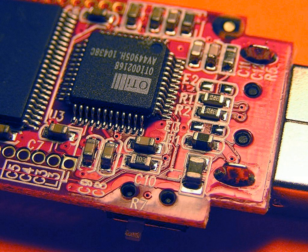Thin small outline package TSOP, thinner than SOIC with smaller pin spacing of 0.5 mm. Shrink small outline package SSOP, pin spacing of 0.65 mm, sometimes 0.635 mm or in some cases 0.8 mm. Thin shrink small outline package TSSOP. Quarter size small outline package QSOP, with pin spacing of 0.635 mm.